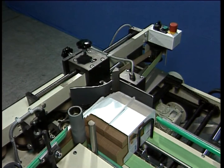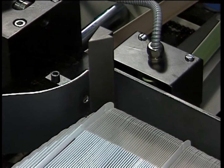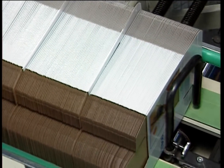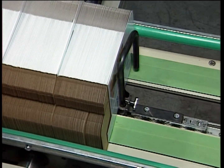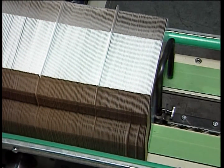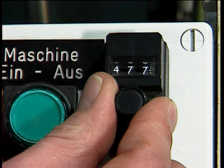At the turning head, the cartons are aligned by means of a turning plate and vibration device. The compact stream of cartons is led away to the side on cross-transport belts. The speed of the cross-transport section is set for the carton being run, or the stream of cartons, via a potentiometer on the control panel.